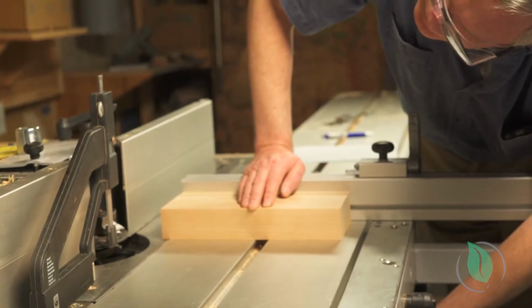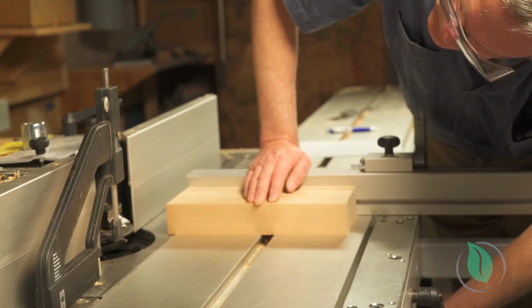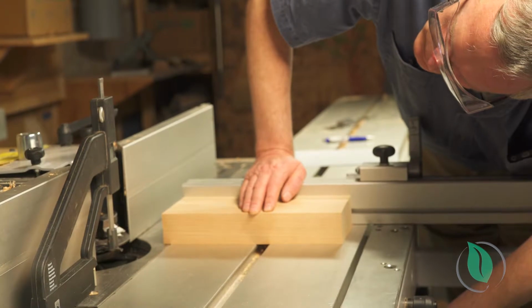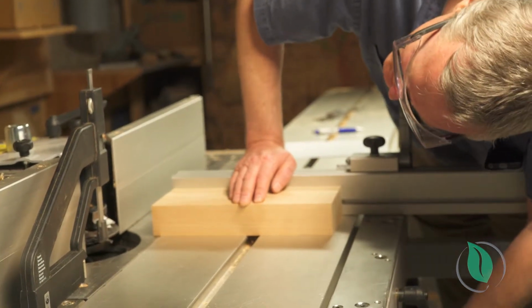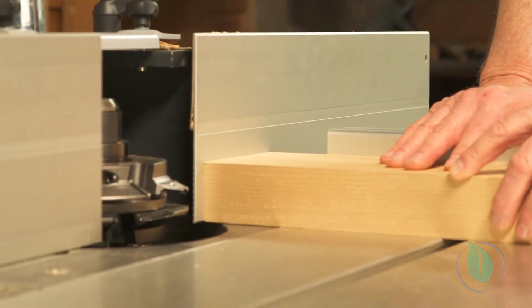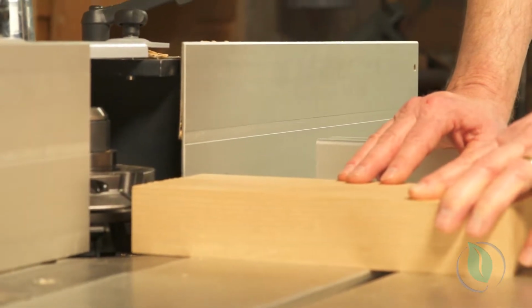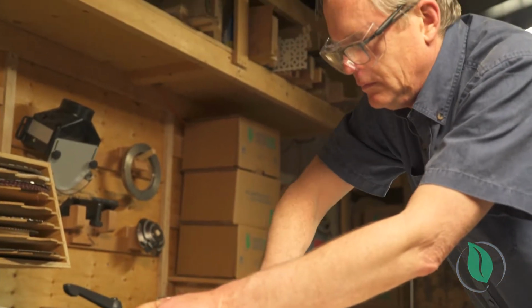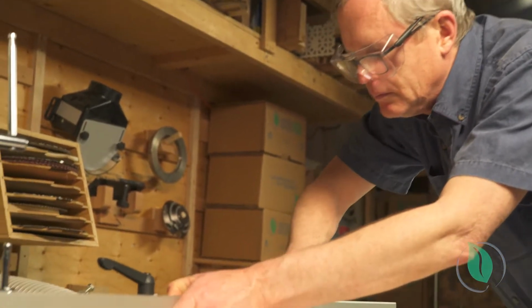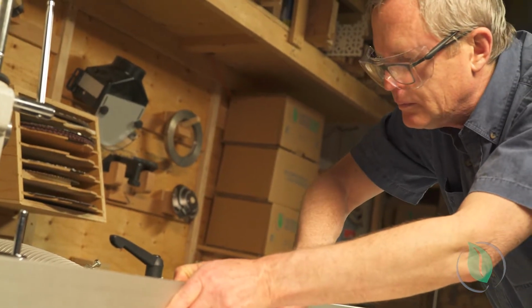Wind the machine spindle up or down to set the tenon shoulder at about 16 millimeters above the table, as measured from the tip of the scoring spur on the lower tool body. We can use the right side infeed fence as a depth stop and to maintain constant material removal. The left side outfeed fence is not used for support or dimension in this cut, so it can be adjusted back farther than the infeed fence.